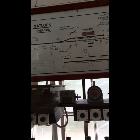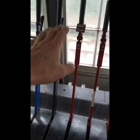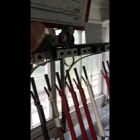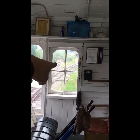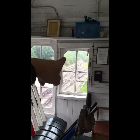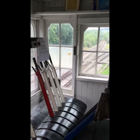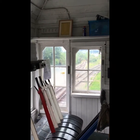Floating wheel detection is probably not the best name for this, but that's the name given — there are other names as well. Basically, the premise is that you can use one lever to clear two signals. We have our double ground signal down there in the sidings, and it protects the loop back into the platform or coming out onto the main line. It's set entirely off the lie of the point, and it's entirely mechanically done.